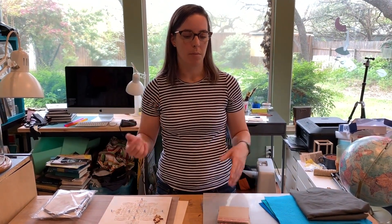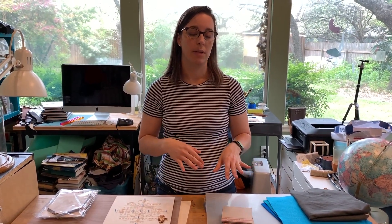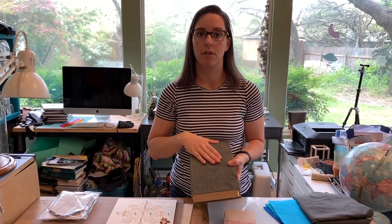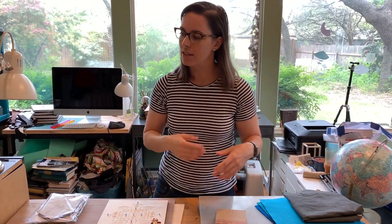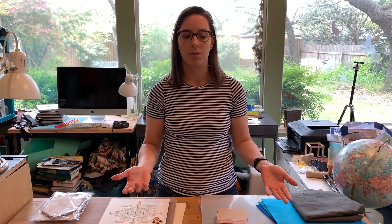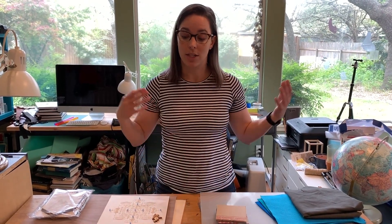That's the overview of all types of materials most recommended for laser cutters. Keep in mind: if the material is not overly hard, overly shiny, or overly thick, you can most likely laser etch and potentially cut it. You can get creative — etching on book covers, cutting through book board, and thinking about fun ways to use a laser cutter outside the norm. Let me know if you have any extra questions about materials. I'll be posting more videos soon showing how the materials look in the laser cutter. Thanks!